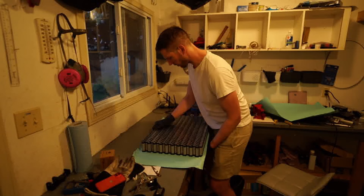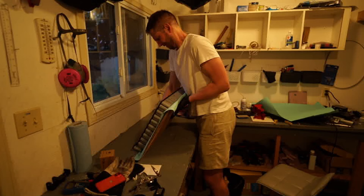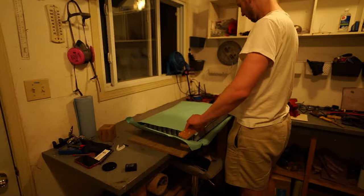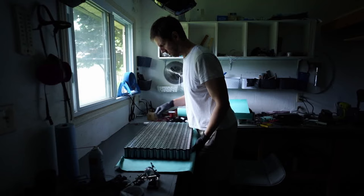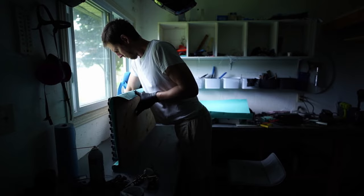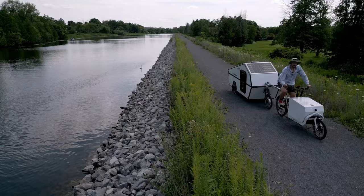Flipping the battery was not as straightforward as I planned. The battery weighs about 90 pounds, and as I first tried to flip it, the cells started falling out of the cell holders. I had to think of another way. I decided to clamp the bottom rows with a piece of strapping screwed into the bottom plywood plate — seems to do the trick. Now with one side spot welded in place, I lifted it again and everything's okay. I'm also wondering whether the nickel strips will be strong enough to keep this battery together as one unit while I handle it and put it into the battery box on the bullet bike.